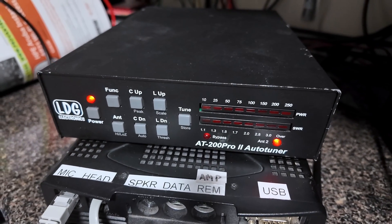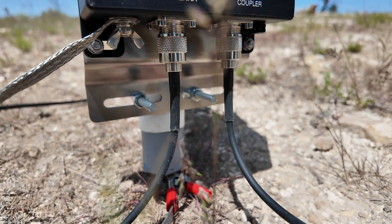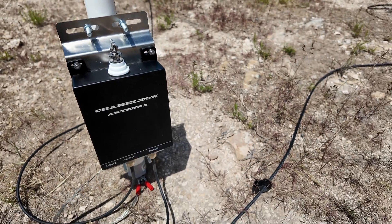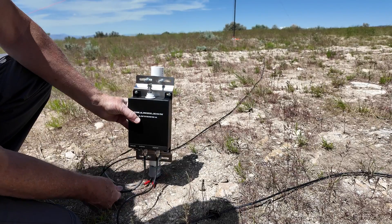Other tuners are always on, holding that tune wherever you move, which is why you have to press the tune button — you're reactivating it. If saving battery isn't a big deal, pushing a button might be annoying for you, but I didn't find it traumatic and it worked well into the workflow. The URT-1 allows you to hook up two different antennas: the beehive connector on top is for a wire antenna, and the UHF connector on the bottom is for hooking up a coax-fed antenna like a dipole. You can only hook up one antenna at a time.